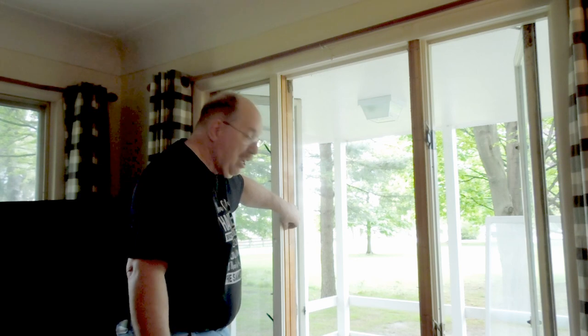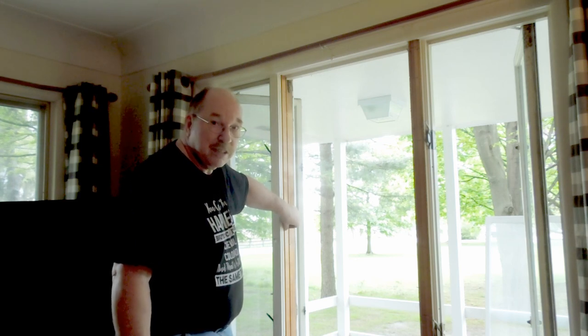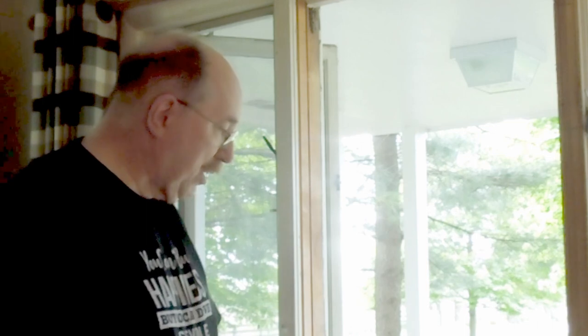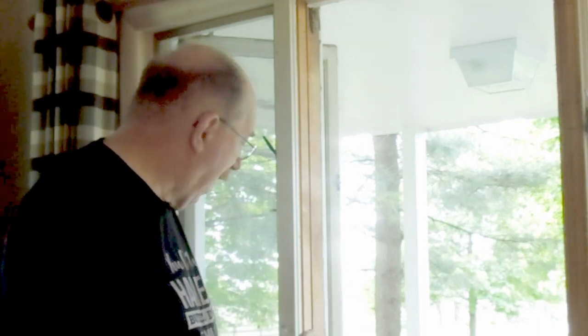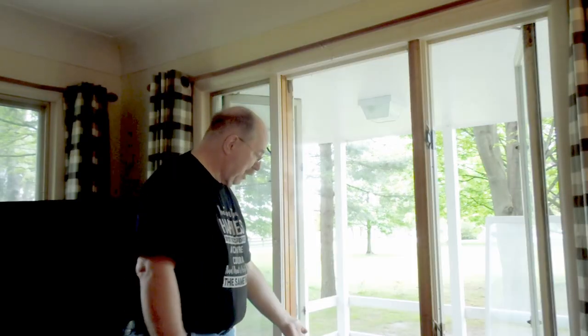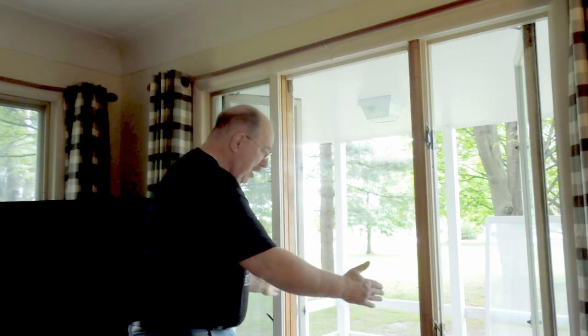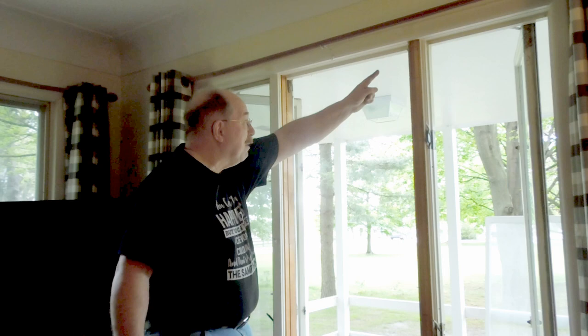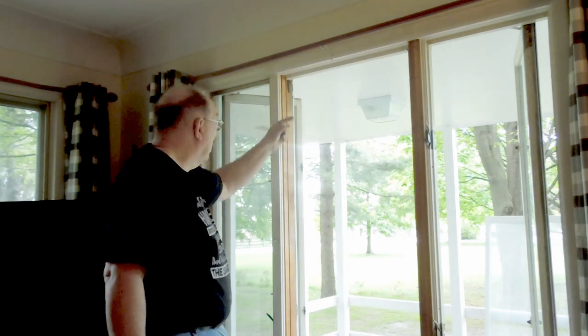Because these sideboards are mortised, actually kind of like tongue and grooved into this side piece. It's got a dado on the board here, and the board that goes in, it's got a dado. So it's got to come out this way. So take the bottom piece loose, slide the sides in, and tip them out, and then you can pry them out past that upper board.